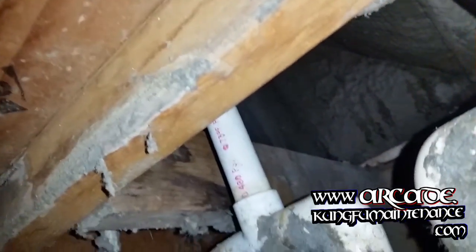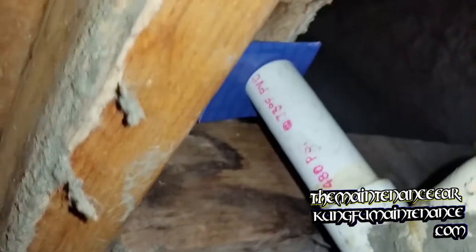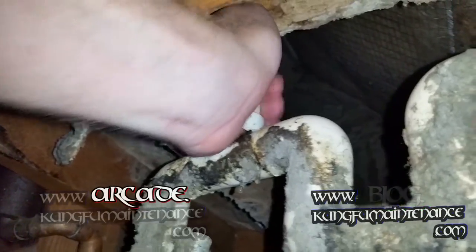At the loop that comes out of the top — I'll explain that a little bit more. But here it wasn't pulling any suction, which is no fun. If it did work, what you want to do is block the vent so it pulls all the way to the drain pan. But this one wasn't even getting any suction to the vent, which means I had something else going on — requiring a deeper look.